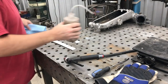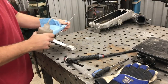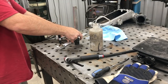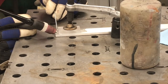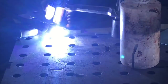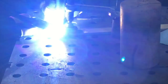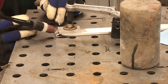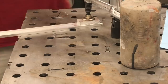I'm also making sure everything — including the filler rod — is very clean. I've got my Eastwood TIG 200 turned all the way up to 200 amps, and a CK 17 torch which I think is only rated for 150, but these are little short welds so that shouldn't be a problem. I'm also running 50/50 argon and helium, which should help with the ability to drive this in hot.